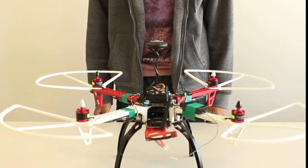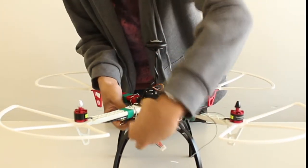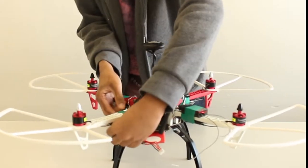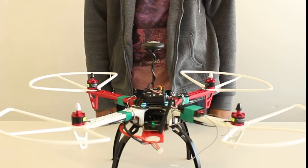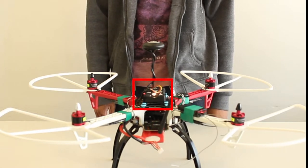The first step is to connect the PixHawk to the LiPo battery via the power module. Make sure that the ends of the power module are connected to the ESC wires and LiPo battery, and the 6-pin wire to the power port of PixHawk. The LED will light and the buzzer will produce a musical tone indicating it is powered on.